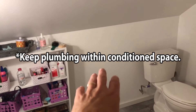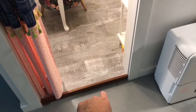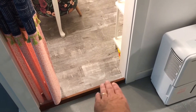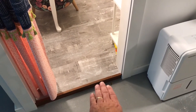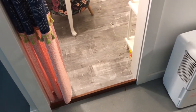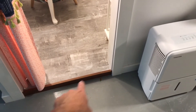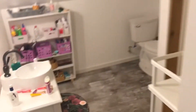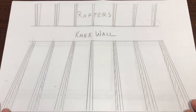If you live in a cold climate you're probably going to want blanket insulation. The way I built this floor up — I'll explain this better in the drawings — beneath here, on top of the joist, I glued and screwed a one-by layer and a two-by layer. That is built up one and a half plus three quarters, so two and a quarter inches on top of the joist. I'll show you in the drawings exactly how this was done — hopefully you can understand my artwork.